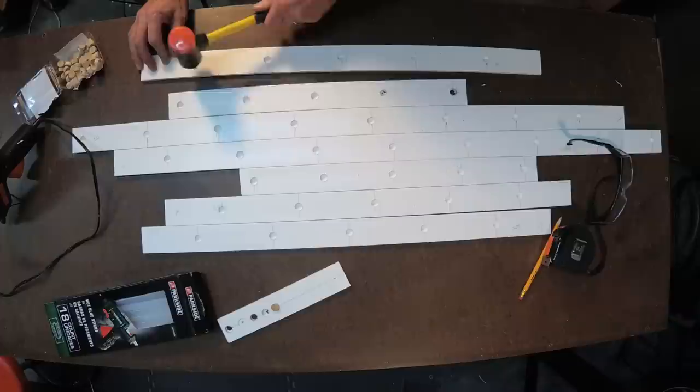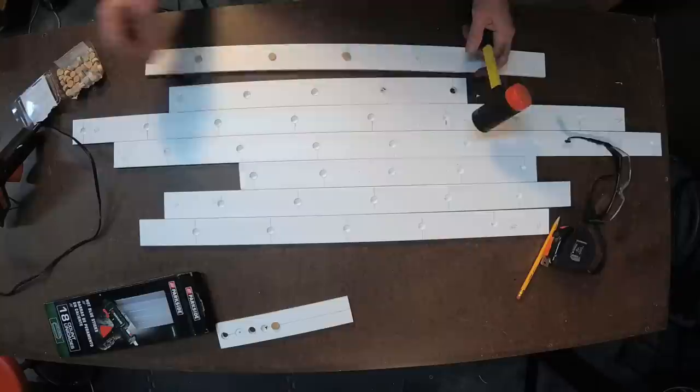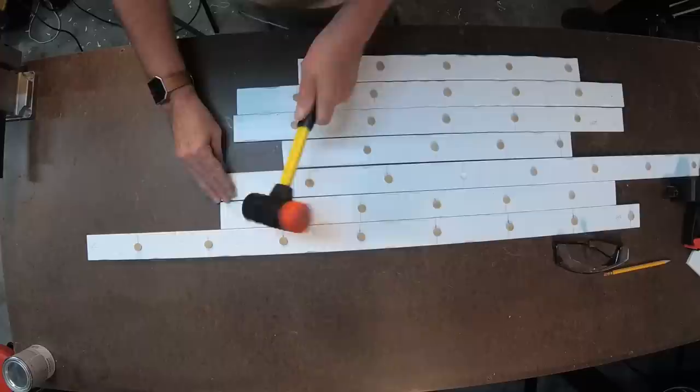I want to drive these in so that they're a tight fit — it'll just give it kind of a rugged look. You could have used the rounded type, and that's all in preference, but I like the sharpness of these. After putting the wood plugs into everything, I'm going to take a knife and just rough up some of the edging. It cuts fairly easy, and also using a hammer, I'm just going to nick up the material.